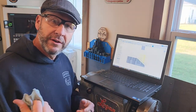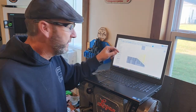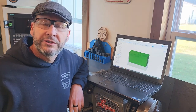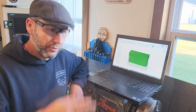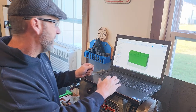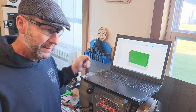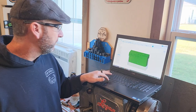So today I'm going to be working on the reciprocal part of that, the bottom foot that will bolt to that top. And here it is on the laptop. I've already done the first op, which is to face its spot and drill through the part, the nominal size for the half 13. I think it's a 27/64 size drill. And now it's flipped in the vise, and ready for the second op, which I'll show on film here in detail.